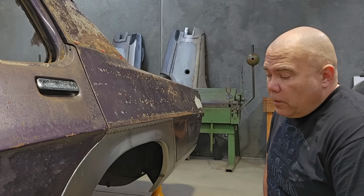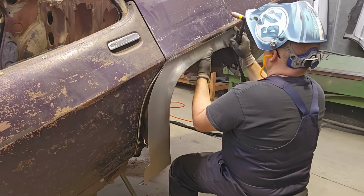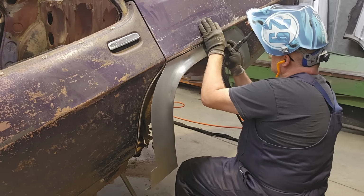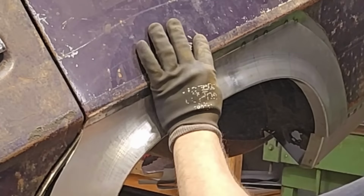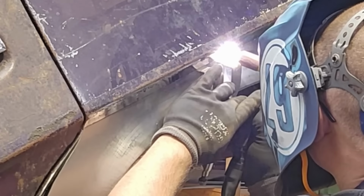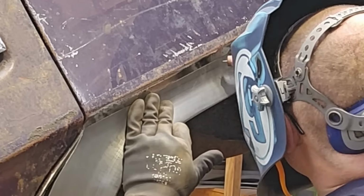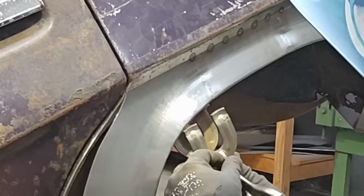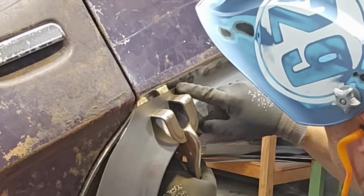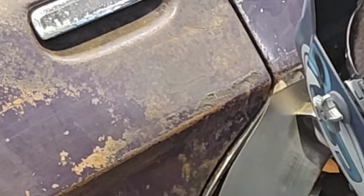It's always a good feeling when you get to pick the welder up, and you can't do that until you've got a part that's finished and fitting really well in the hole. But once you've gone through the process and you've checked everything to make sure that you've done all your fabrication, obviously once you start welding it in there, you don't really want to be messing with your piece afterwards. It might get a little bit of tweaking once it's welded in the car, but we want to get it as good as we can. And so we've committed to our final cut lines, we've trimmed the car out, making sure that the hole size is fitting really well to our new piece, and then we get to pick the TIG up and start welding it into the car.